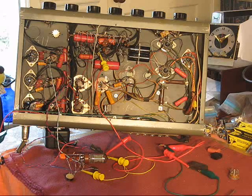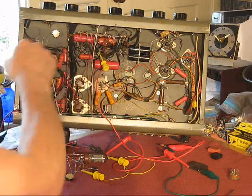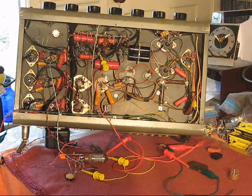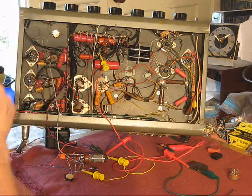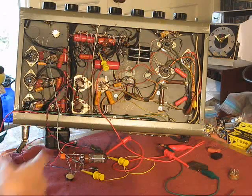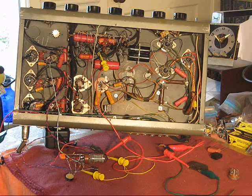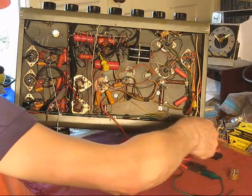It's probably difficult to pick up with this camera's microphone, if you can call it a microphone. But it's liquidy. It is shifting the tone response of the circuit a little bit, enough to detect wow wow instead of whoop whoop whoop. It's kind of cool. Which of course is also influenced by the bass and treble controls on this thing, because of where this modulator is tapped in.